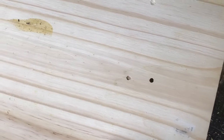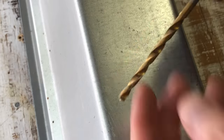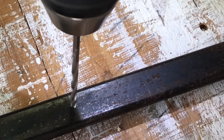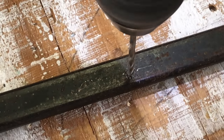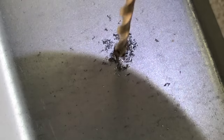But that's not the case for metal. Tip number seven: use slow speeds for drilling metal. Carpenters don't work with metal as much as welders or plumbers, but it does come up. The key to drilling metal is using slow speeds and pressure — I know I just said don't use too much force, but when drilling metal it does make a difference. Metal wants to carve away in cleaner scoops than wood, sometimes coming out in long curly cues or just little chips. If your bit is spinning too fast, it won't be able to dig in and start scooping — it'll just skip over the surface, quickly heating up and dulling itself. Slow your speed down drastically and use as much pressure as you think the bit will take without breaking. The cutting tip will slowly dig in and begin gouging out material, and you'll see a cone-shaped depression forming. Drill until you punch through, then consider letting your bit cool down between rounds.